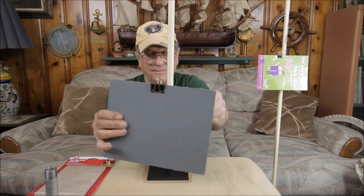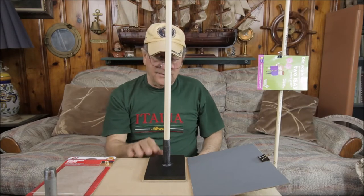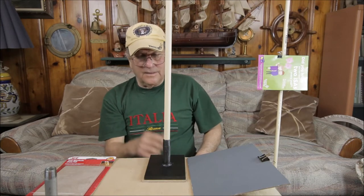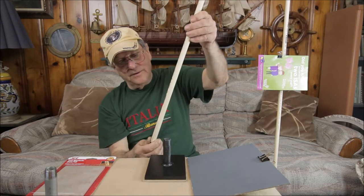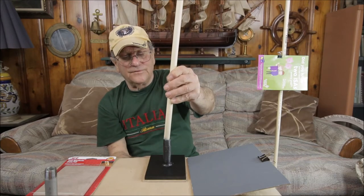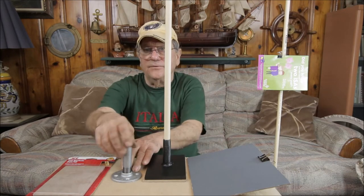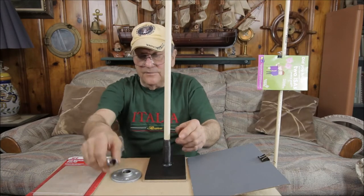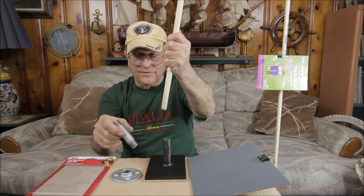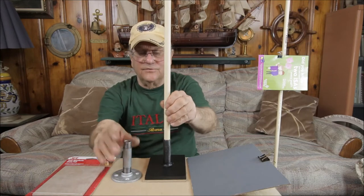I want to show you how I made this. I have a shop with access to welding equipment. I made this base out of 3/8 plate — it's probably four by five inches, kind of weighty. This piece of tubing I bought at a hardware center is hot and cold water PVC tubing. It fits real nicely inside a half-inch pipe. One caution though: I bought this other piece to show how to build it, and for some reason this pipe doesn't fit too well, so I'd go to the store, get a piece of pipe first, and then find a piece of tubing that fits it well.